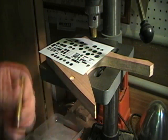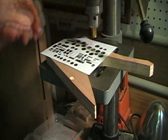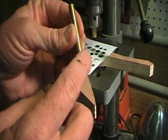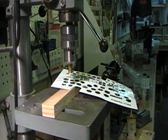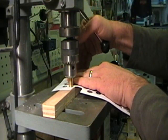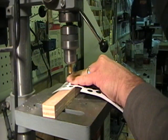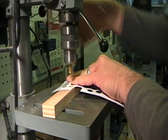I've done that to this piece here. To set it in the drill press — this is only hand-tightened. If you tighten it down with the chuck key it'll just break and mess up your brass, so I generally just turn it on and grab it and let it tighten itself. To cut the gauge, it's real easy — before you turn it on, come in and find your center on whichever gauge you're going to cut. Just hold it in place, turn it on, it doesn't take much pressure.